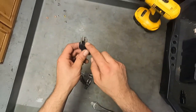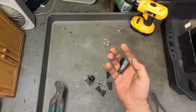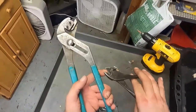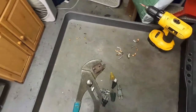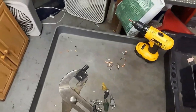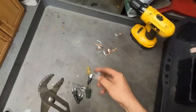We'll get these brass plugs off and get the little bit of copper that's left inside them. A lot of guys will boil these to make them softer — you don't need to do that. All you got to do is get a pair of channel locks, put the plug in here like this, put a firm grip on it, and then take a pair of side cutters and just twist it — it'll pull it out completely. These guys waste a lot of time boiling these and it gets messy. You can see how quickly I can do these. There's no reason to go to that extra trouble. So you can see it just pulls right out — very easy. On my channel, I do the simplest method possible with as little work as possible.